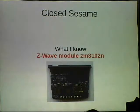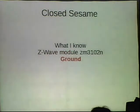It also talks to the main board over UART, which is just a serial communication protocol, just like those old DB9 serial connectors that everybody uses. So I was able to find out where those pins were, and that really set everything way ahead, because knowing those things, you could actually begin to look at traffic and get going.